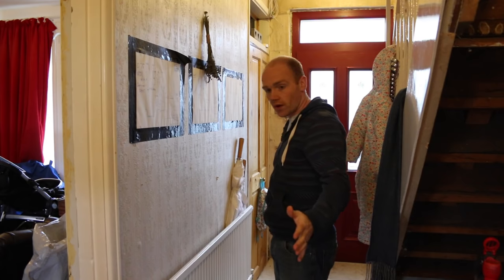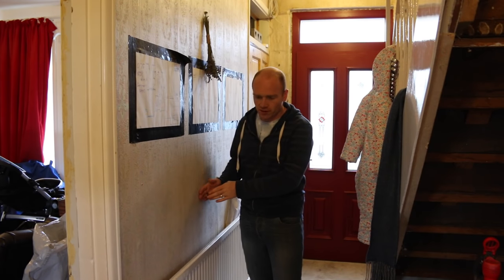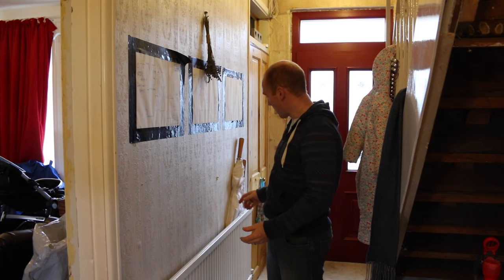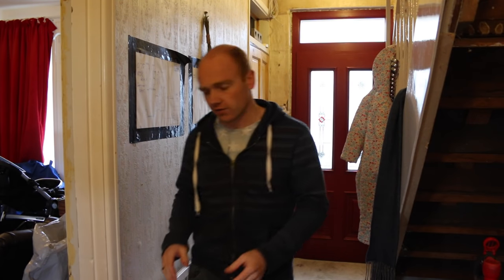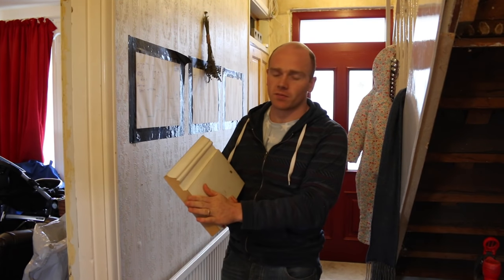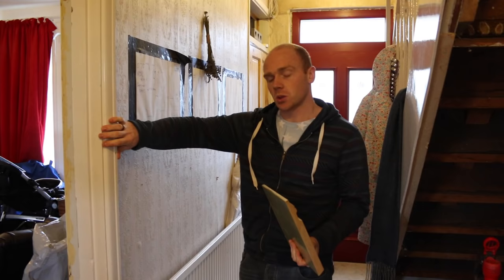Coming back down on this side of the hallway - we originally planned to do paneling on the lower half of the wall, similar to the dining room, but it would have meant bringing the wall out by another inch or two and it's already quite narrow here. So instead we're going to have that high skirting board along the bottom and then just a dado rail for a bit of an accent or feature. The high skirting at nearly 12 inches means pushchair wheels, boots, or kids on toy bikes still won't mark the wall and can easily be wiped.